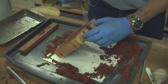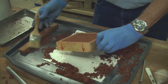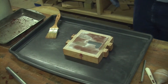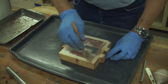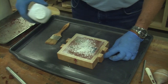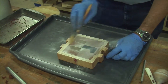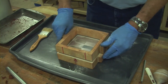There's the drag — that's all rammed tight. This is the view of the center of our flask. See those two parts? I'm going to put a little bit of talc on here to help the two halves separate easily. We don't want them to stick together. Now I'll put the second half on, which is actually the top.